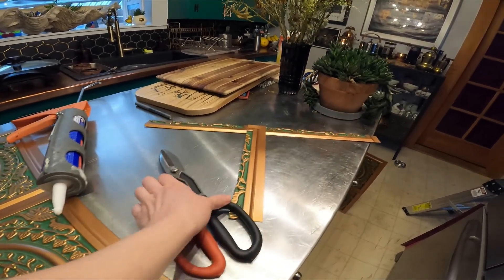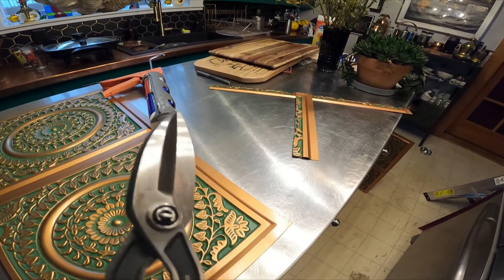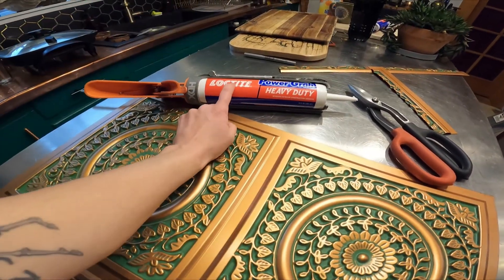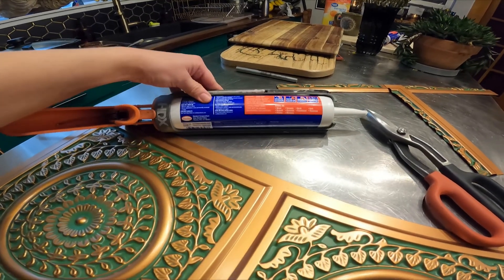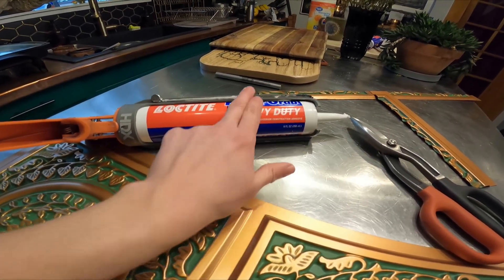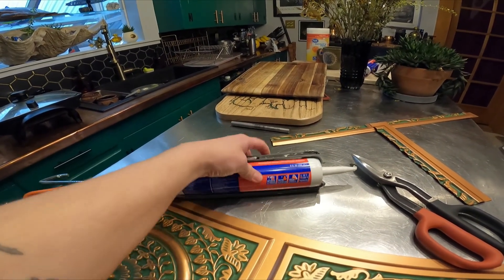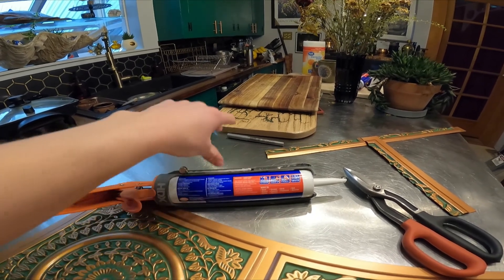After making the markings you cut it, and I've found that heavy tin snips are the best tool — I've tried scissors and a box cutter, but these cut so smoothly. Then you glue it up, and you want to use Power Grab. Specifically the Loctite heavy duty Power Grab zero second. Some of the cheaper versions of industrial adhesive are thin and not very viscous, but this one is zero second — as soon as you place it on the ceiling it holds and you don't have to stand there just holding it up for 10 minutes.